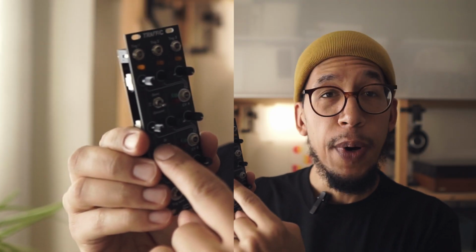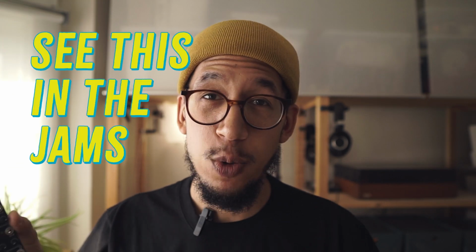The first thing is that there's a switch on the module to change the outputs to unipolar, which is positive only, or bipolar, which is positive and negative. The second thing is there's a switch right here that randomizes the outputs in two different flavors. This is exactly what I mean about playing around with the patch once it's all set to go. There's a random element in the switching, but then you can get right back to what you had initially. Not to mention, you can change things up completely just by sending different trigger sequences into the inputs.